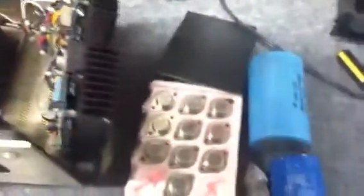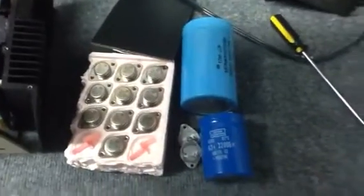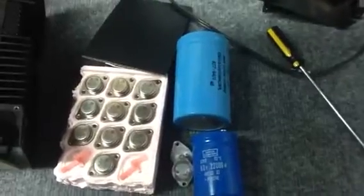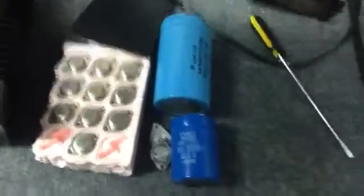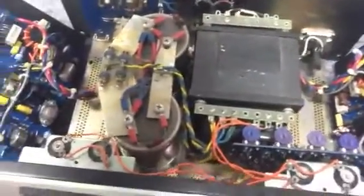The transistor here was the major problem. Protection circuits have been redone, both driver boards recapped, meter circuit recapped, putting all new output transistors in it — it had actually all bad outputs in the one channel. These are capacitors — that's the normal size, and this is the one sitting behind it that's what's going in there. That's the size that fits, which is not necessary, and there's the old caps right there.